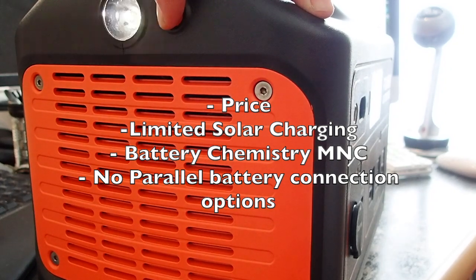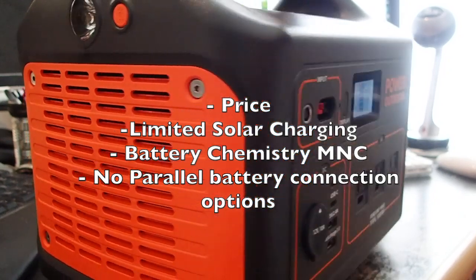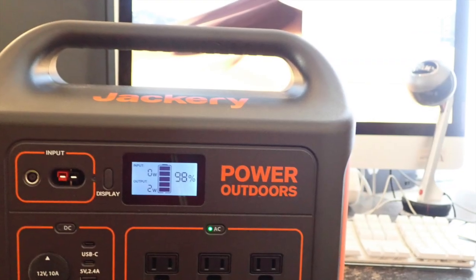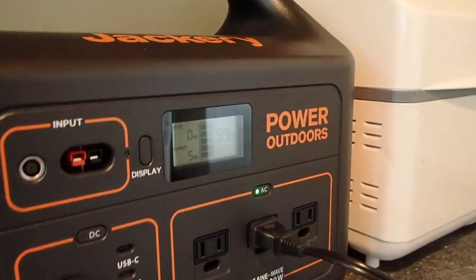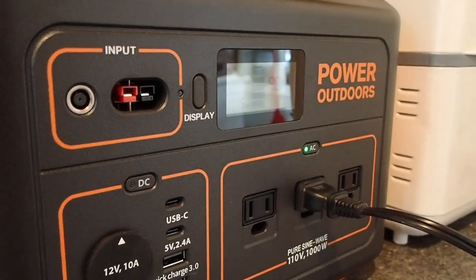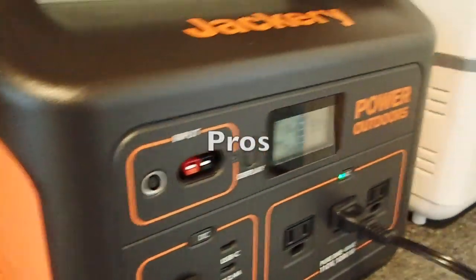There's no easy way to connect it to larger battery banks. The only way would be to use the 12 volt adapter, but you'd get max 10 amps flowing through that. You can hook it in parallel with other 12 volt batteries, but you'd only get about 10 amps out of it. For camping that's not terrible, but you certainly can't expect large amperage out of this in parallel, and you won't be able to charge it from an AGM either due to different voltages.